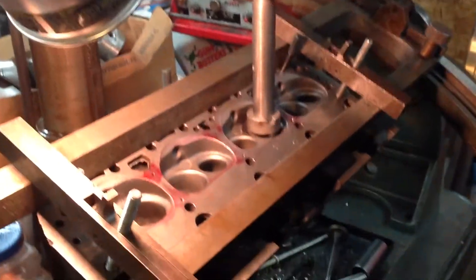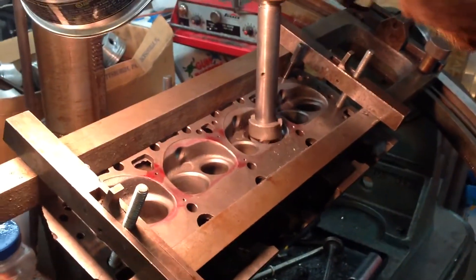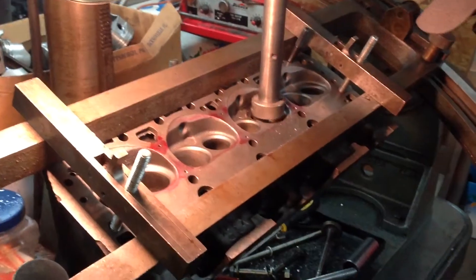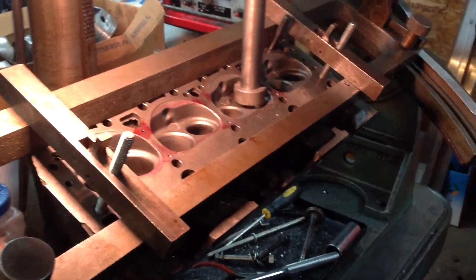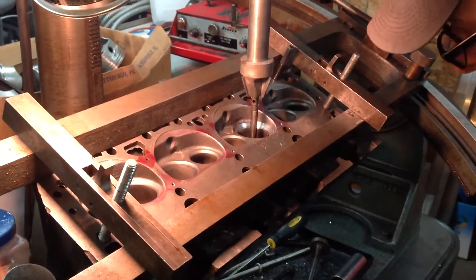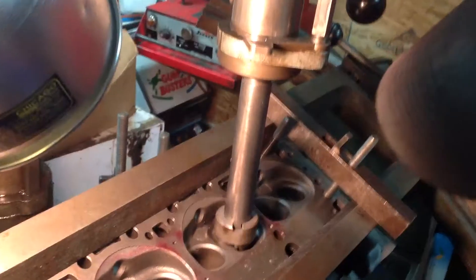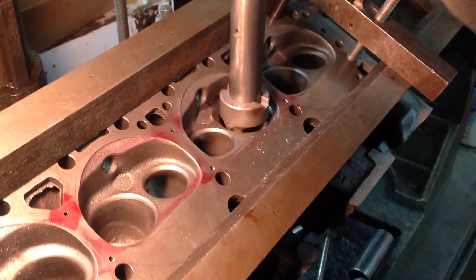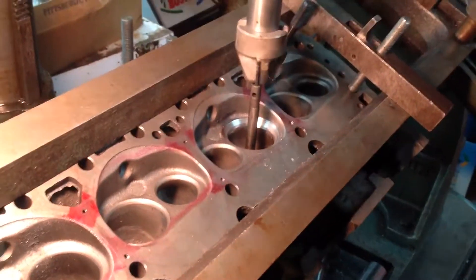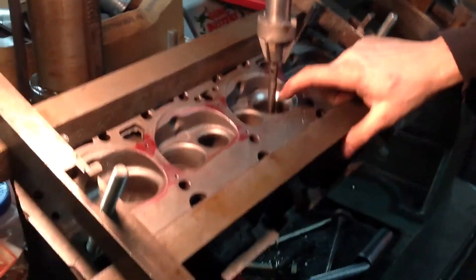This is called a bull hog or a throat cutter. We did 70 degrees. So that's my 70-degree bull angle — I've got a 30, 45, and a 60, and then a 70 that transitions into the bull, or the throat of the bull hog.